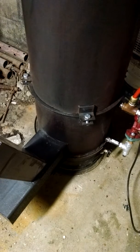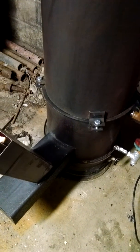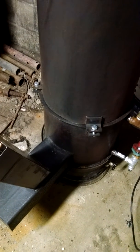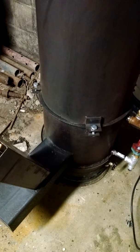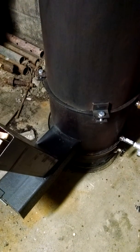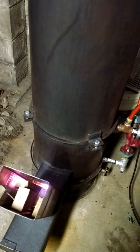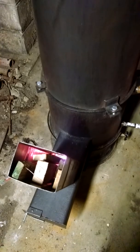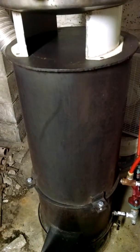On the bottom section I've got about the bottom one-quarter to one-third of that chimney pipe, and probably almost half of that firebox inside with a water jacket around it. That was just my idea — something to do with this rocket stove to see if I can heat water with it. And it seems to be working.